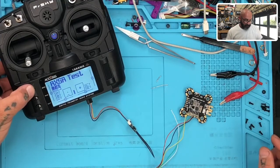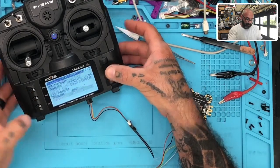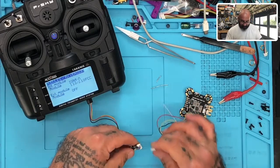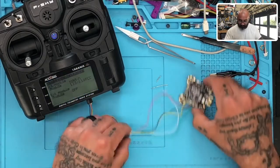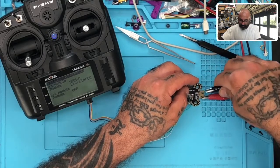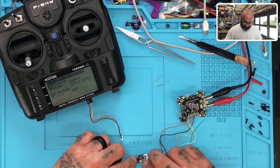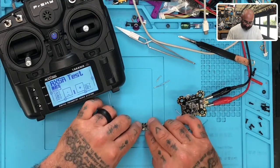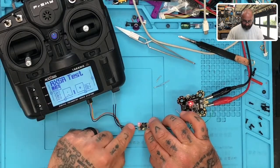So yeah, when you're here, you get the menu and then page, page, page — keep going until you get to the option for modules, RX version. You can see it's 2.1.0. These two should bind without any issue now. So I'm going to disconnect the RXSR and put it back on the flight controller. I've already changed my wires here. This is going to be an F port test. I'm going to get ready to bind it, and we're going to be using ACCST still. I'm going to hold the bind button and turn it on.